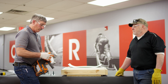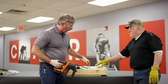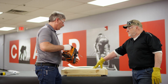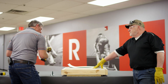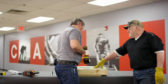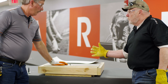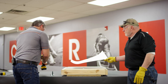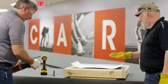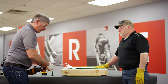Yep, so this is my 3/16ths. We go inch and a half into the deck plus our half inch high density. This is the one with our star bit. Notice how I hold this in place in case a wind comes along. Okay, so now we're going to install our membrane. Now we're going to have to switch our bits.